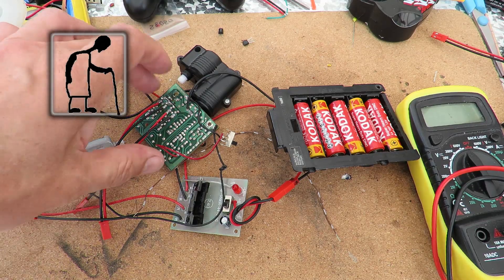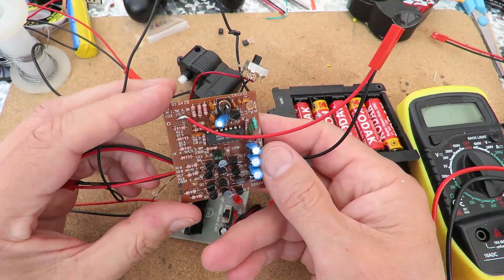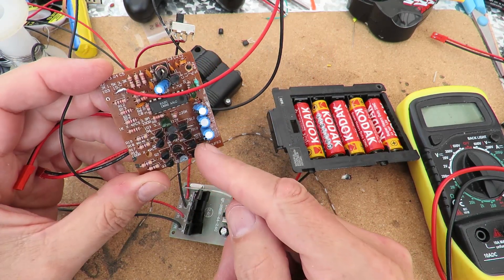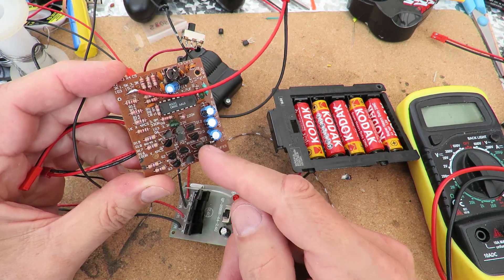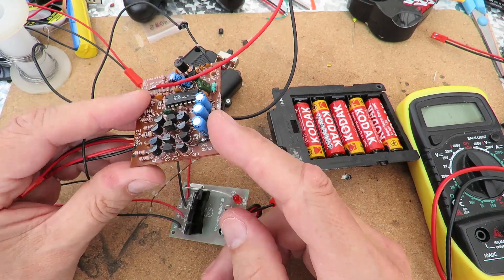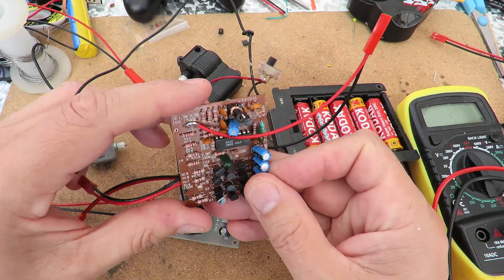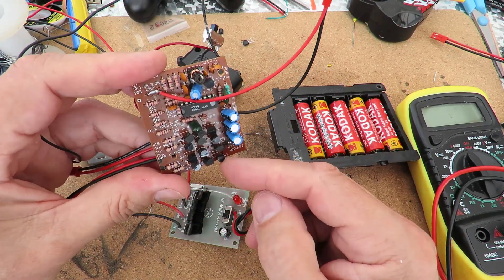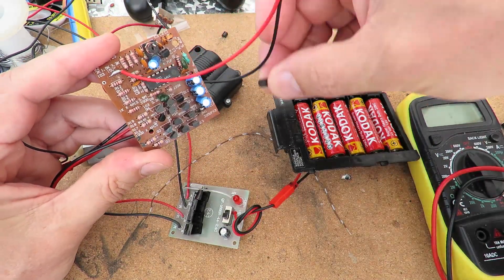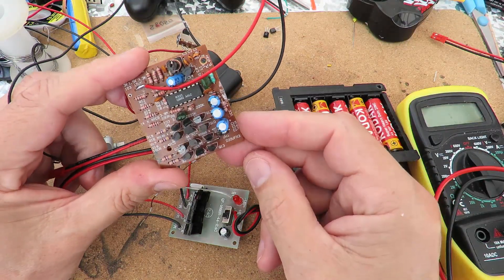Hi guys. Last night I was working on this toy grade receiver, 27 MHz. I replaced two of the transistors here, which were in the H-bridge, because I burnt them out by putting too much current through them. And that worked — that was successful. There'll be a video link in the description so you can look at that. It's fairly straightforward, just me taking those two transistors out and replacing them, and that got it working.